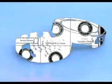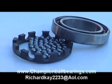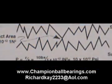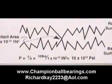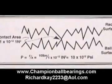Why do I need a hybrid bearing? If you cannot tolerate conventional hydrocarbon or fluorocarbon lubricants, your system will experience micro-weld adhesion. Micro-weld adhesion occurs with a welding of microscopic peaks due to millions of pounds of pressure occurring at even a minimal load. This repetitious welding produces heat and rapid failure of the bearing.